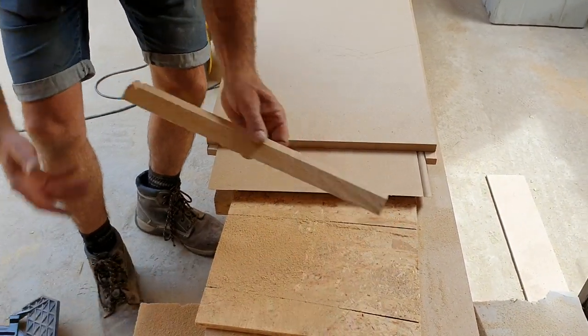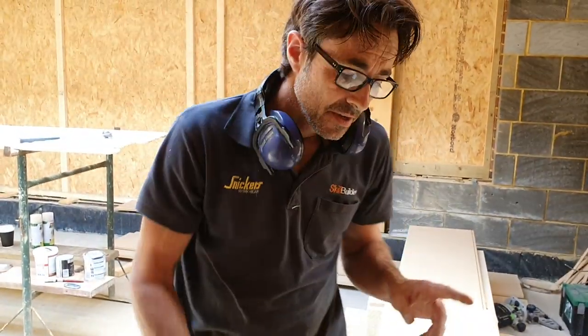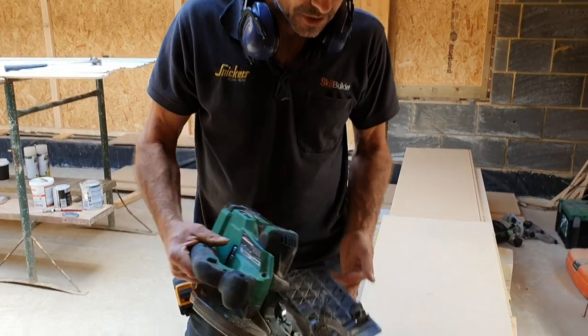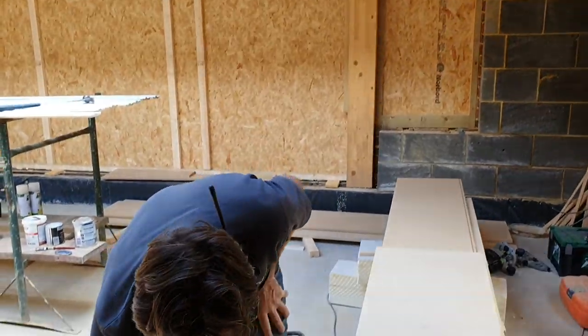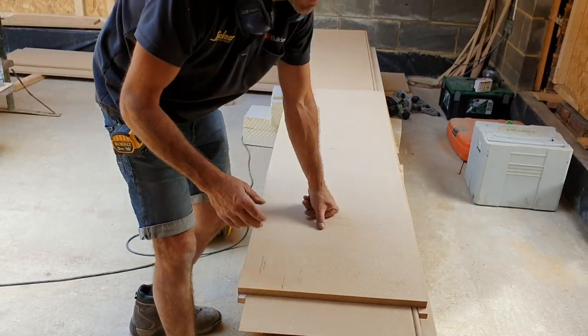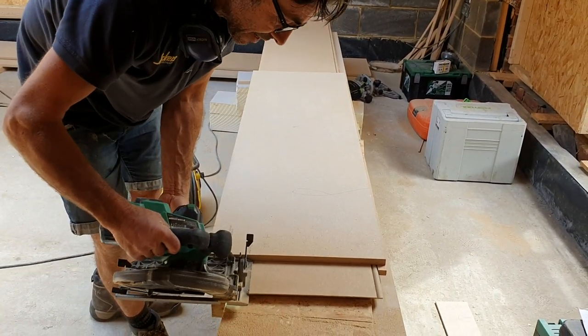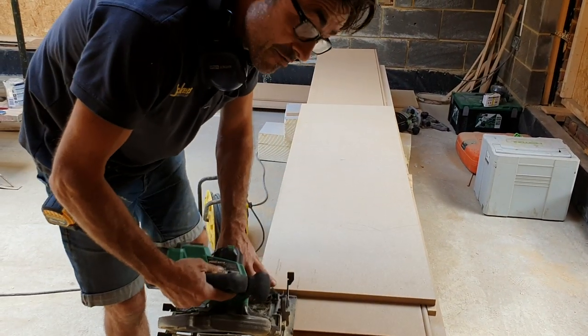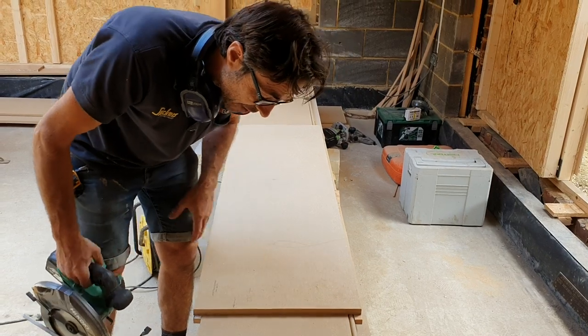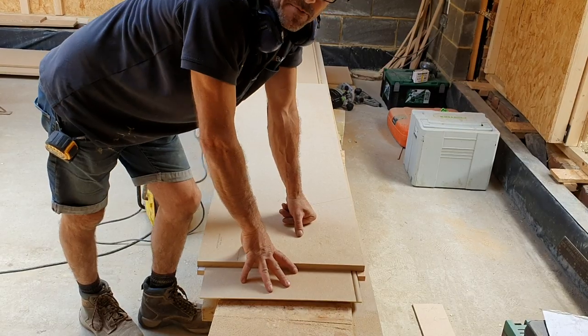So there we have it — a really, really straight, flat mitre. Carpenters watching this might be thinking they'd use a rail saw for that, and yes I've got different rail saws. However, if you use a rail saw at 45 degrees, some of them — as seen in the Skill Builder rail saw roundup — have a small tab that clips into the rail to stop it tipping out. My Festool one is prone to slipping out, which gives you vibration and a nasty cut. This is a much better way for me — I've got this beautiful base plate, keep my weight on it, gently go through, and I get a perfectly true cut.